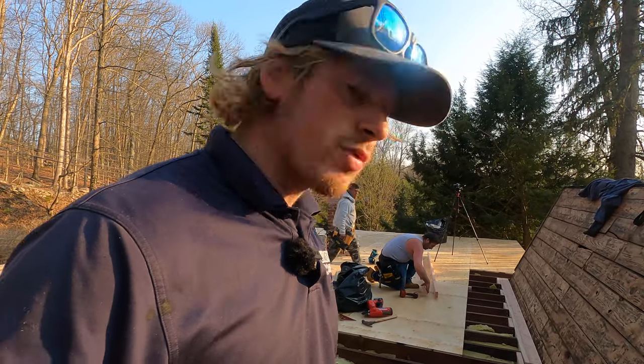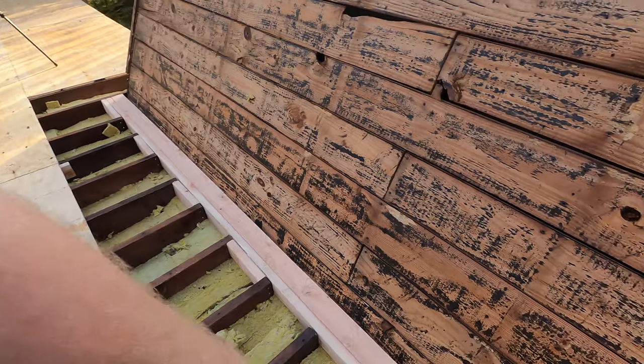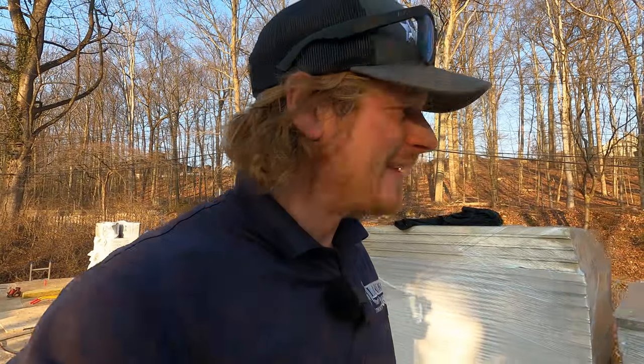To fix this hack job, we're adding a couple of two-by-fours — some blocks to secure an L-shape — so we have a more solid surface to nail the plywood down. The reason we're rushing so badly is because it's supposed to rain tomorrow morning at eight o'clock. We have to get this at least temporarily waterproof — the insulation doesn't have to go down first, but we do have to put the TPO down temporarily. Tarps are not waterproof, so we have to make our own temporary cover. We'll be here for a while.